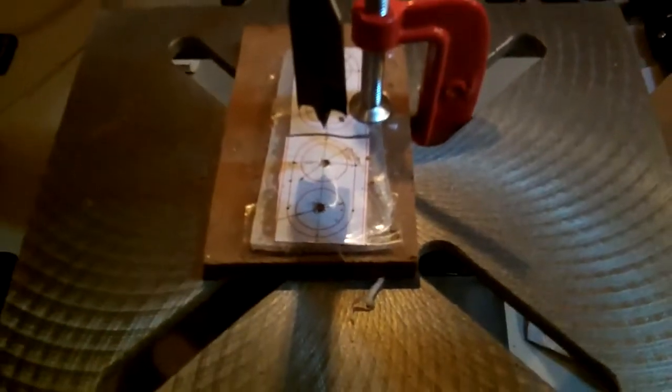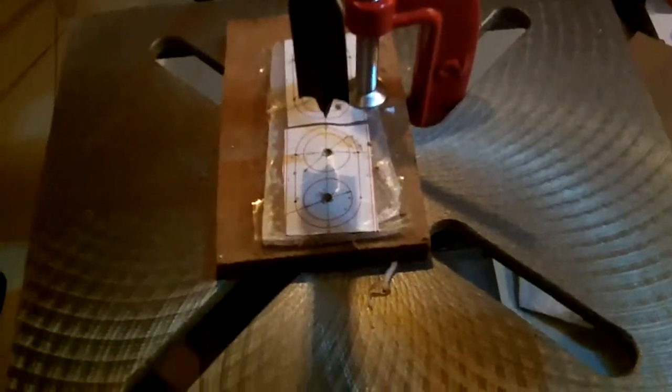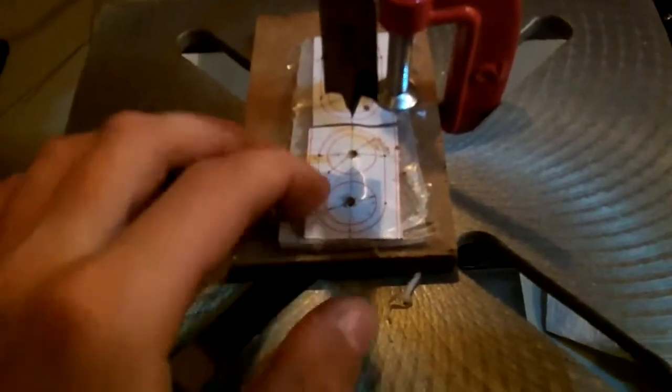Okay, now that I have all 4 pilot holes drilled, I have the 5/8 bit ready to go. It's a spade bit, however you could use any normal bit. And you see how that pilot hole will guide the center right in. That's exactly what you want, so that's why making the pilot hole is very important. I'm going to cut out these larger holes for the CPVC now, and then I'm going to scroll saw out this, and I'll show you it as I go along.